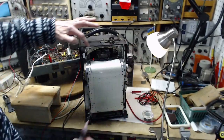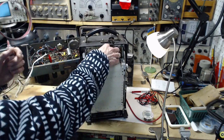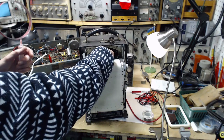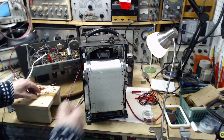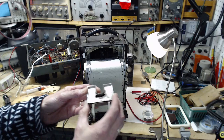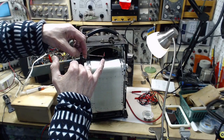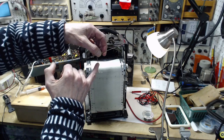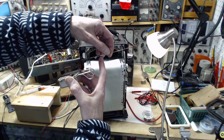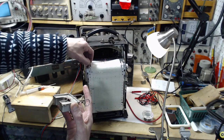Now, meter movements here. This is the ink tray that you put ink in. This is the pointer that delivers the ink. This is the point where the ink comes out, writing on the paper. This is where the ink goes in. It rides inside the tank. And it's just because of the small dimension of the pipe here that ink is drawn along to the end. Plus, it's being wiped off. It's being drawn out onto the paper, so more ink comes out.